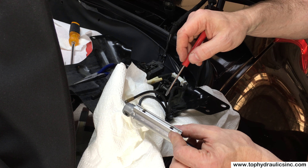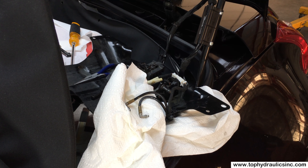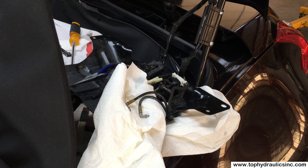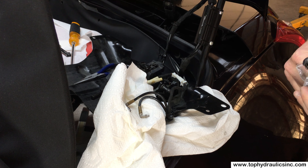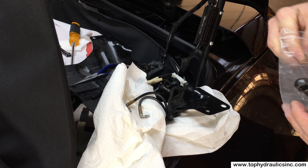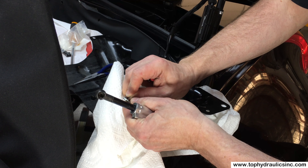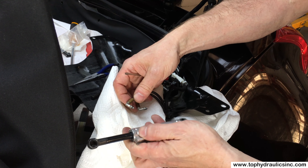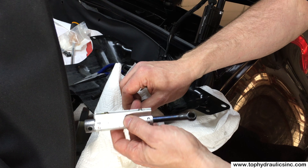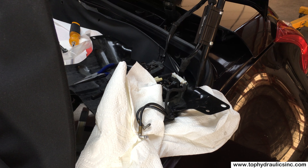When you put your replacement cylinder in, you have to put new O-rings on these fittings first. The cylinder from Top Hydraulics is rebuilt better than new, and it comes with O-rings and instructions on how to install them. I'll get a couple of O-rings here and put them on these fittings. The O-rings from Top Hydraulics come pre-lubed, which makes things easier to install. Line 72 goes on the blunt end, and line 71 goes on the shaft end of the cylinder.